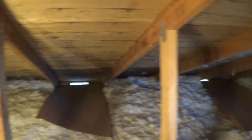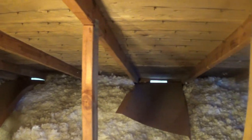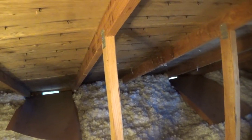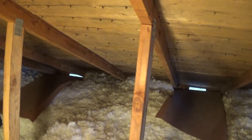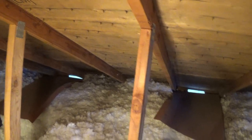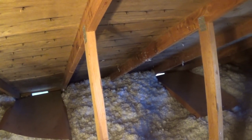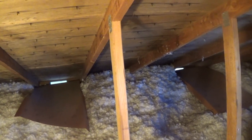Now this was a pretty simple fix for this attic, but yours might be a little more complicated. First, just see where your vents are and check if they're blocked. Second, you may not have enough ventilation in general — you may have to install more vent holes, put a fan in your attic to help redirect moisture, or improve your insulation to prevent moist warm air from your house coming up into your attic. There are a variety of solutions for different types of attics — try to find a solution yourself or hire a professional. I hope this video helped you out and I will see you next time. Bye bye.